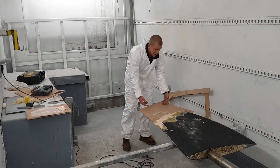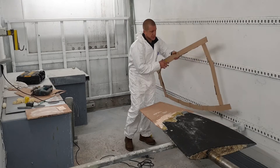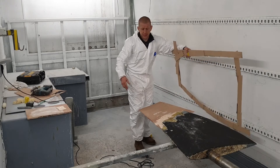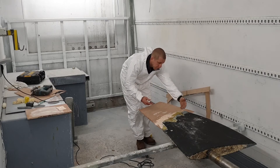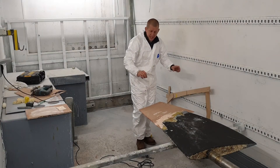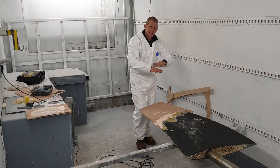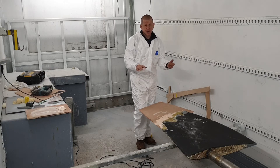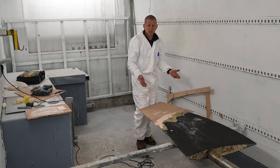It's all glued in the right place now - just a little bit floppy. It's literally tongued in, lots of filler around to hold it, and that's all it needs to be. So the next step would be: get my template on here, draw around it, and then I'll use a jigsaw to cut that out. And from then on we'll start looking at the profile of it, get some straight edges, pull some filler around, and we've got the exact shape on it. The basics are: cut the end off, get something wedged in so you get a centre line, draw your shape back on, and from there it's relatively straightforward. When we need to we'll flip it over - repeated process - but it's a lot easier on the second side once you've already got something to go off.